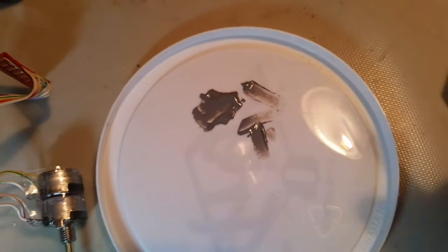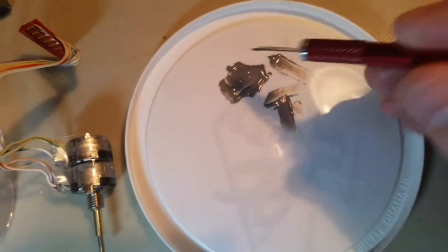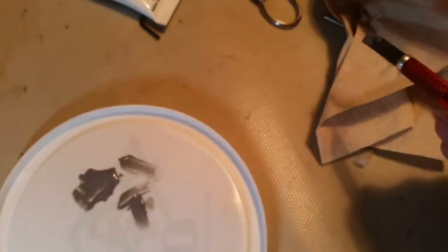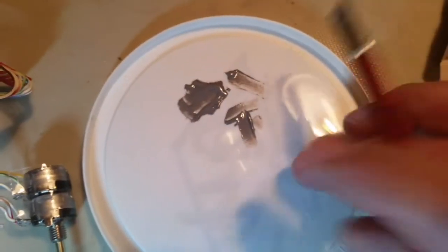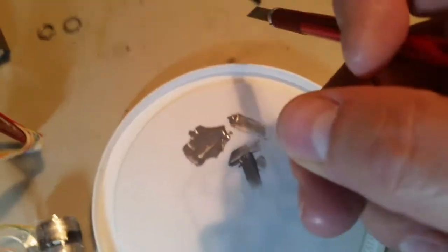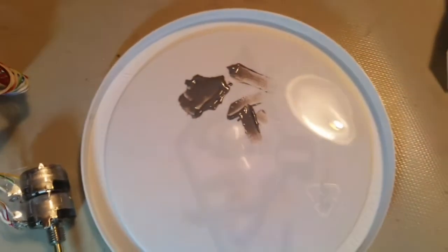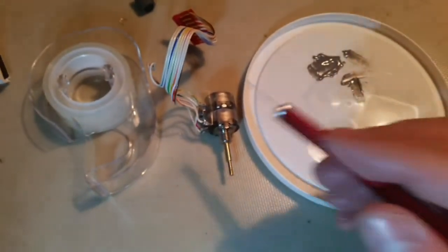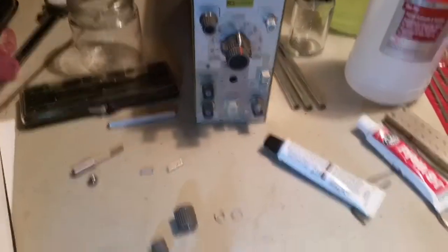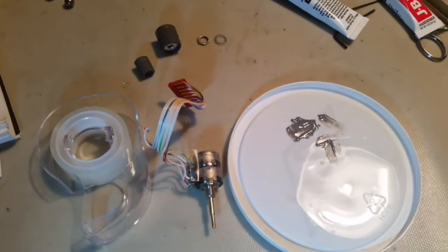For cleaning this up, alcohol dissolves epoxy — and basically JB Weld is epoxy with metal flakes in it. So you just wipe it up on your rag and you can clean this lid back up. If it's thick enough, you can take the lid and twist both sides in opposite directions, and it'll peel, and then hit it with some alcohol and clean it up. Until this dries and I go to reinstall it back in the PG-502, I think I'm going to call it a night here and we'll finish this up tomorrow night. Chit-chat with you later — bye.